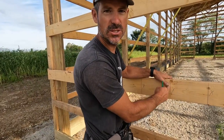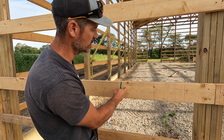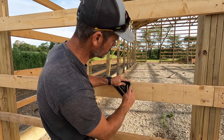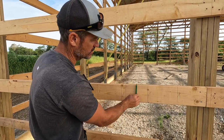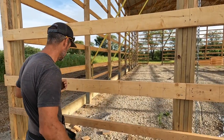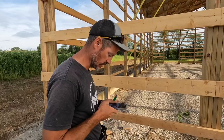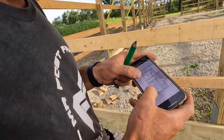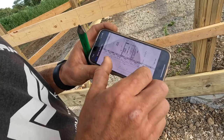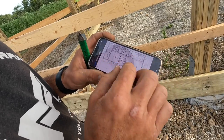When you look at this, the start of my rib is here — ribs are an inch and a half — so this is the start and the end of my rib is an inch and a half over. I want the edges of my windows to lay somewhere in between each of these, so you just have to lay those out accordingly. Now I'm going to tell the guys which window box goes where, using this to get the rough placement of all these windows across the front.